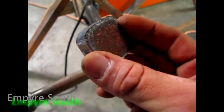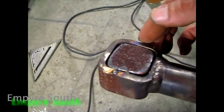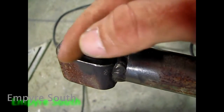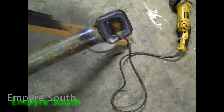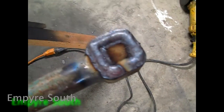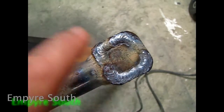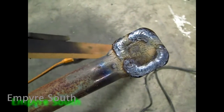So now your next step: take one of your pieces of metal and put it right here in the end. Now what you want to do is make sure that you get it flush right here — you want it flush across the top — and then we're going to weld all this out the same way we did this. We're going to do a root pass, grind on it a little bit, and then run a low hydrogen cap. We're going to do that on both sides. Now we've got it — it should look something like this. Flip it over and have that. This is where our bushing is going to go and we want it to lay flat right in there. So now we've got to grind all that flat and smooth, and then we'll go to drilling the hole in it.